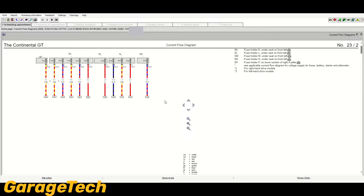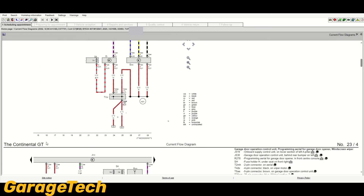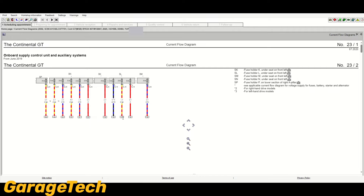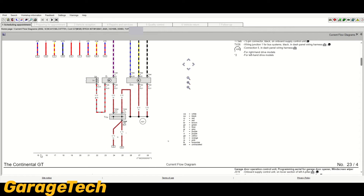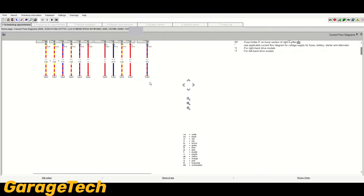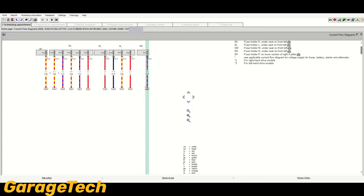Some of the most important things to know about these wiring diagrams — the first and most important part is these track numbers at the bottom. They go all the way along; here we stop at 14, then the next page goes to 15, and so on. These track numbers are really important because they correspond to the numbers inside the continuation boxes. So a wire comes down, hits a box saying 15, meaning that wire continues on the next page at track number 15. If you're using the PC version like this, you can click on it and it'll take you directly to where that wire is.